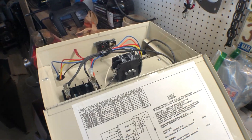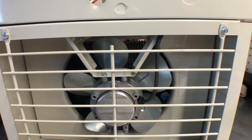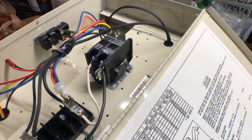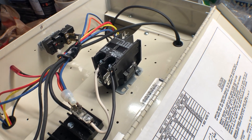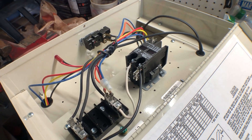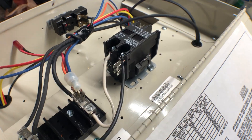I went ahead and got the contactor mounted in here - I used an existing screw in the case and added another self-tapper in an existing hole. When you mount these, make sure your screws don't interfere with any of the guts on the inside. The reason I'm using a contactor is for safety - contactors are made to control a heavy load, like a 240-volt load, with just a little 120-volt switch. So I can use a 15 or 20-amp switch to control this heavy load. They use them in factories and shops where one switch runs a contactor to control lights, big motors, and heavy equipment.